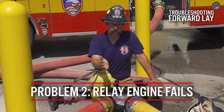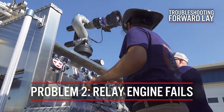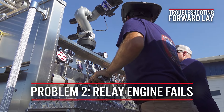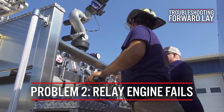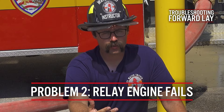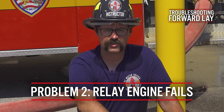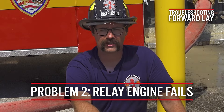Now it may not be the desired flow rate, but water will still go to the fire scene. The attack engine is going to see a drop in their intake pressure, which is going to require them to gate back so they don't cavitate their pump or collapse their supply line. However, they will not completely lose water, and this will allow them to either readjust their strategy until we can get another supply engine in position to go ahead and boost the pressure again.